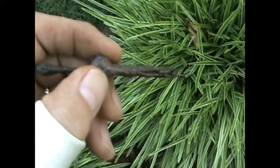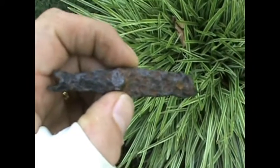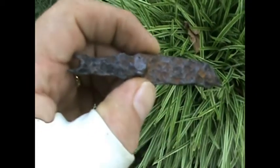So what you're picking up is the two divisions in the gun tool, a little bit more defined with the electrolysis. You've got most of the surface rust off, all the pitting and the nodules are off, and what we're going to do now is — the cleaning is done — we're going to do the preservation, the last part.